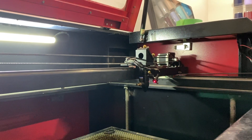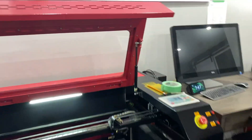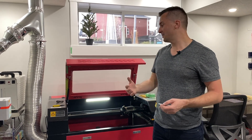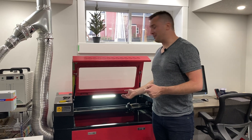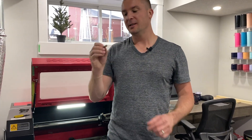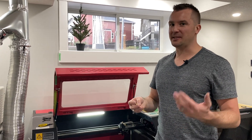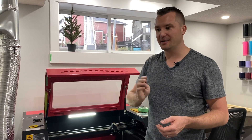Okay, I think that should probably do it. So that's everything we're really doing on our maintenance today. There are other times we do even larger maintenance — I haven't had to replace the laser tube yet, but next time we do that we'll record another video, because that means realigning all the mirrors and it takes a very long time. The other thing you might want to do after this is bring up your bed and run a ramp test — just to make sure you have the right focal point. We use this little 9mm piece of wood because we know that 9mm gives us the perfect focal point when we're laser engraving. We will record another video to show you what a ramp test is — basically you put a piece of wood on an angle, run a laser mark, and find at which point the laser mark is the finest. Stay tuned for that. Thanks.